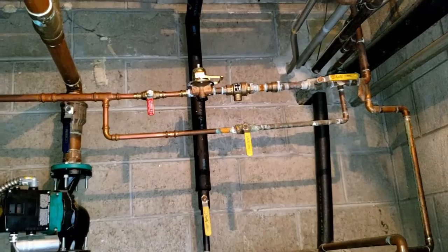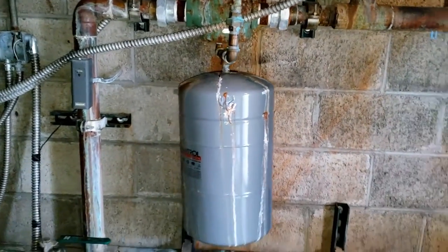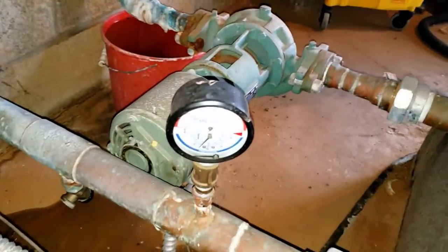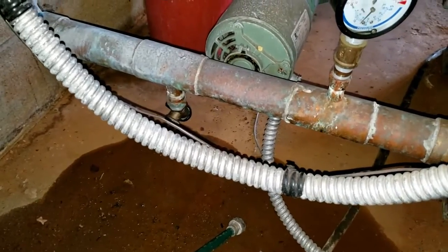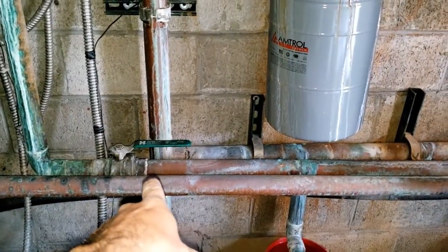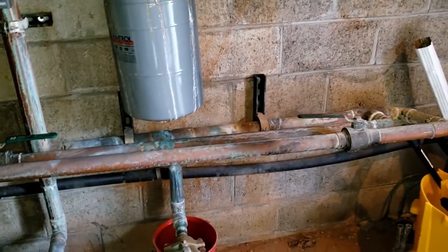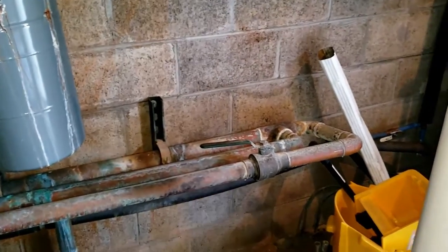You've got circulator pumps pushing the water out, an expansion tank that's shot, an auto bleeder on top that doesn't work, a gauge that's bad, and a drain down there that doesn't work either. What I want to do is valve off here and here, then when I add water it'll pressurize, go through the system out through the check valves, all the way through the loop, and back again. Then when it comes back down I'll be able to bleed it out through a boiler drain, pushing all the air through.